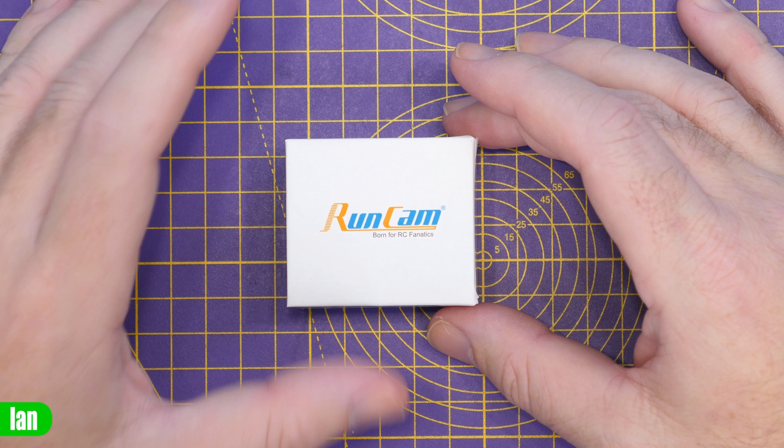I need to confirm that this is the second revision of this video. The initial video was taken down due to an issue with the latency testing results. Initially I found the latency on the Micro V3 being higher than the Micro V2. It turns out this was a result of our test method and wasn't actually correct. The Micro V3 is a lot more sensitive than the previous cameras, and as a result of the way we do our latency testing — by shining an LED into the camera lens and measuring the time between it shining on the camera and on the display — it was actually overloading the sensor.